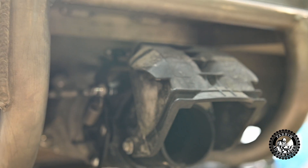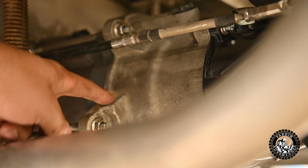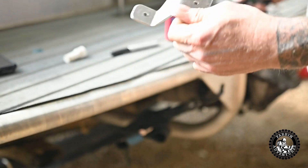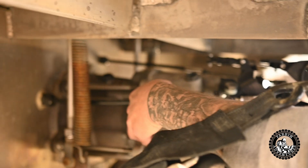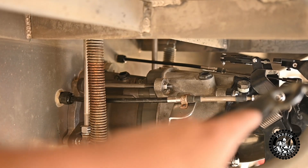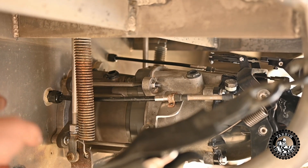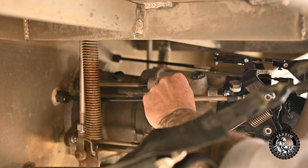We got the old reverse bucket on and the nozzles on now — that's basically just a bolt-up. We just have to build a couple of brackets from this hole up to here to stop the wiggle. Munster does supply a longer extension rod, but with the way this is set up and the different reverse bucket we put on, we just slid the cable further out through the hull and made this bracket instead.